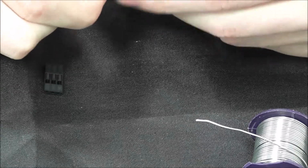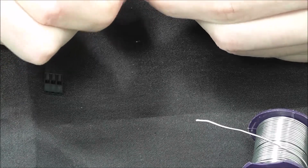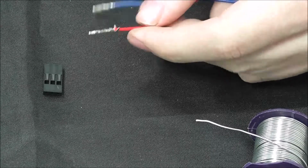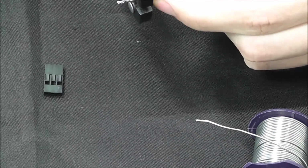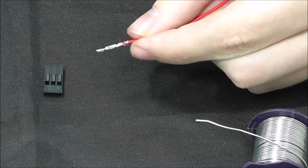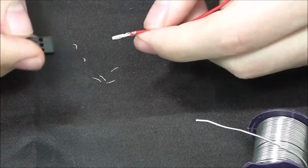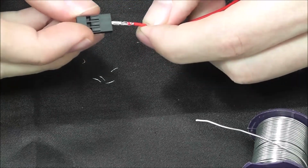So you should slide it through there until the arms at the bottom of the crimping piece are wrapped around the unexposed wire. Then we're going to bring over our crimping tool and pinch it essentially so that those two arms look like they are hugging the wire. And then we're going to cut off the extra on the end. Alright, then these two pieces, remember red is our COM in this instance, so we are going to stick it in the middle port.